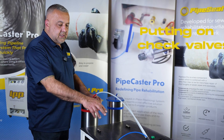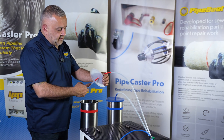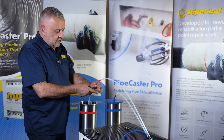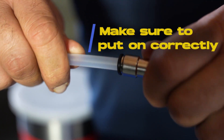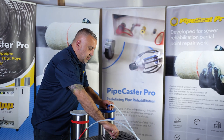Once you've done your measurement, go ahead stop your pumps. Lift the lid up — if you have a little bit of backflow, let it stop. Once the backflow stops, go ahead put in your check valves — they come in your kit. Pop them in here. This will force the product not to go backwards and will hold pressure. Do the same thing on the resin side.